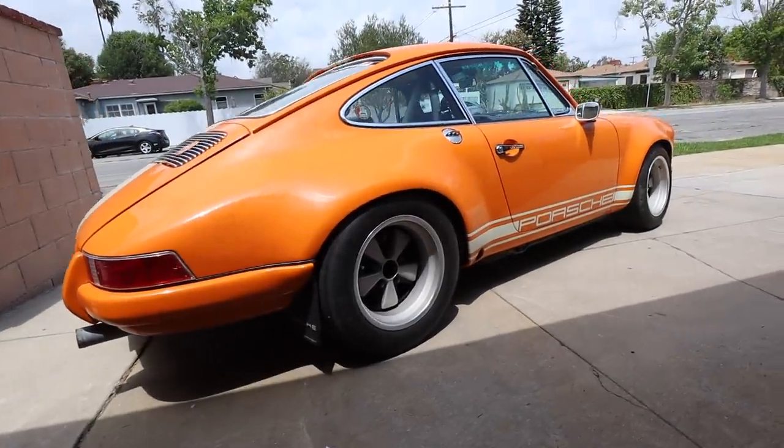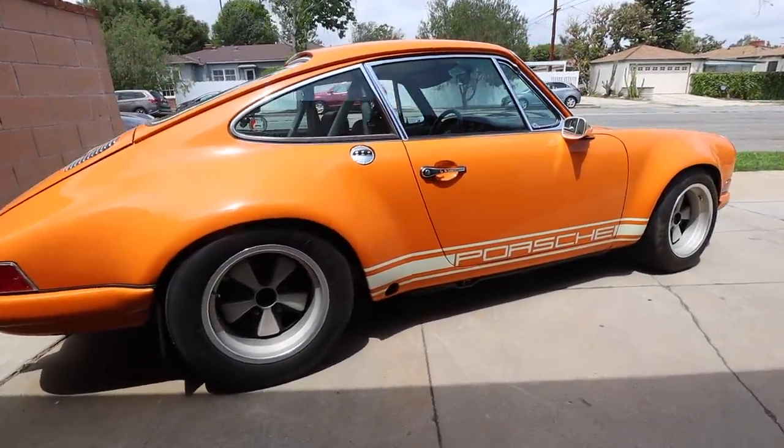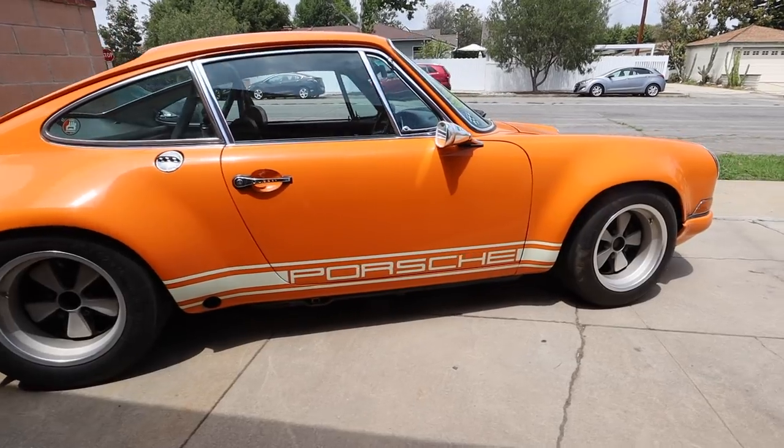Now, if you watched the last episode, Dave Buzoglu from TRE Motorsports came by with this brilliant super ST hot rod where we took a ton of measurements off of. Because of those measurements, we decided that we had to hack the front flares in half and cut a 40 millimeter section out of them. I have to do the same thing on today's show to the other side. So that's gonna be the first thing I try to accomplish on this episode.